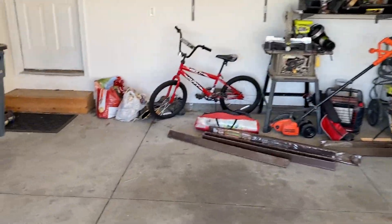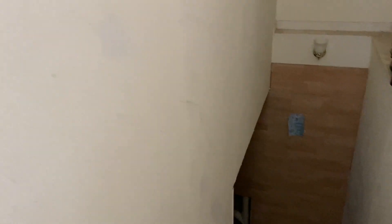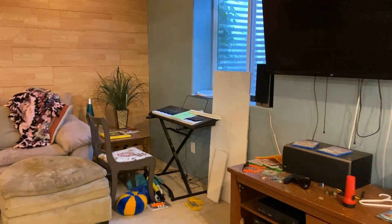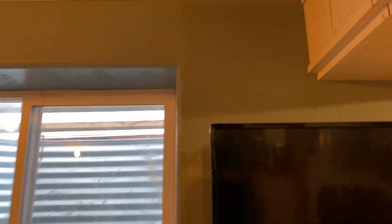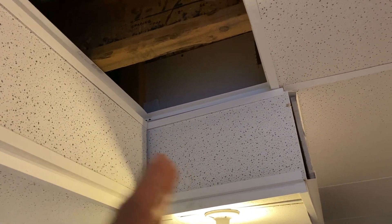Let's go in the house — I want to show you the power. Right up here, that is my power going out. We drilled through the floor — you can see the line there. The 12-3 goes over here. I have staples in to hold it away from the water and hold it in place. It goes all the way down through here. Luckily I did this basement myself and I did the drop ceiling, so if I had to put cables in there, I could do it like this — made it a lot easier.